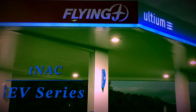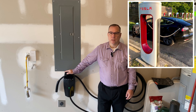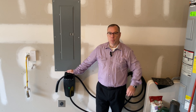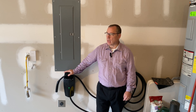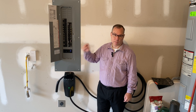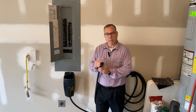This is an 80-amp adapter allowing you to charge at 19.2 kilowatts. We had this unit installed when we purchased our Tesla 2019 Model 3 Long Range, and it's wired directly into the breaker on a 60-amp circuit, providing 48 amps of throughput at 11.5 to 11.6 kilowatts. In order to upgrade it — this is a Gen 2 unit which can do 80 amps — we would have to upgrade the breaker circuit from 60 amps to 100 amps, which would provide continuous throughput of 80 amps through the Tesla charger.